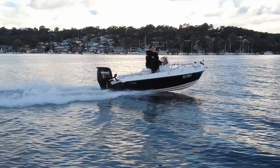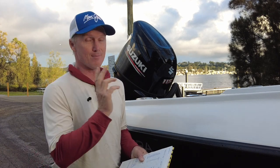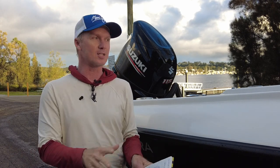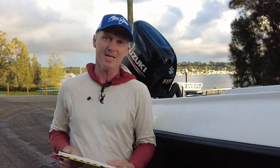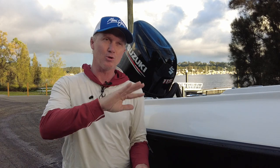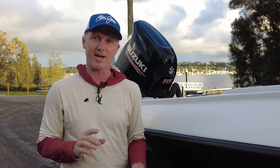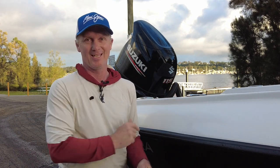It's very responsive to trim as well. I can see guys wanting to cross coastal bars on this — I love the fact that they hit the throttle and move straight away. When you're coming back in a following sea, you can trim that hull angle exactly right so it's both dry and comfortable. There's 100 litres of fuel underfloor. Typically this motor on a rig will give you two to three kilometres per litre, so the standard 100-litre tank gives you 200-plus kilometres of range. You can also talk to Jason about a 140-litre tank if more range is your thing — prop it right and you could get 300 kilometres plus, suiting guys who want to do big reef adventures in a small boat.